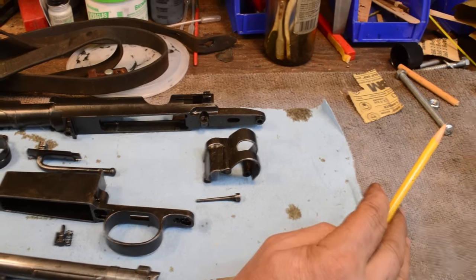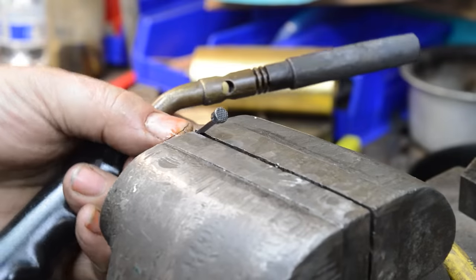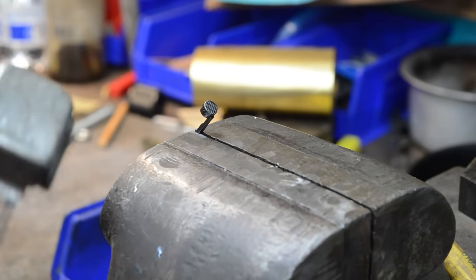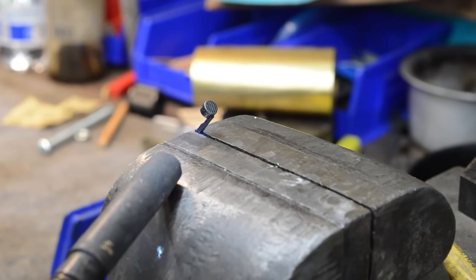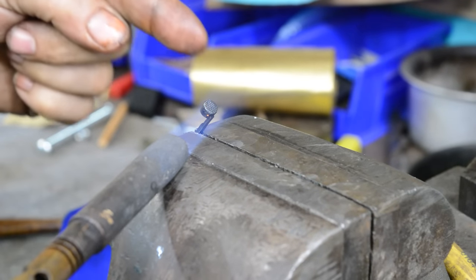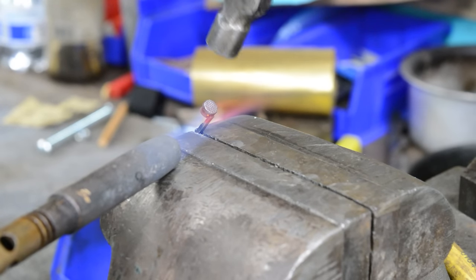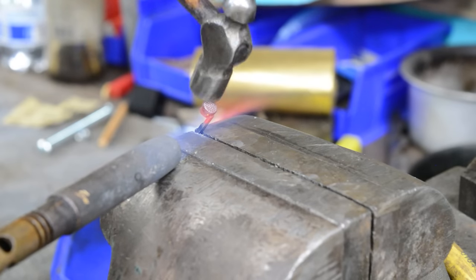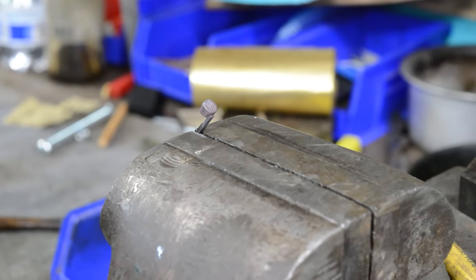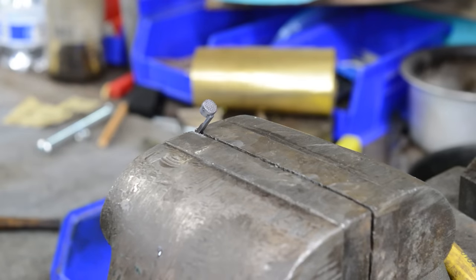There were some results of this inspection part. Let's pop over to the big vise and deal with that rear sight. This is the piece that was bent and I'm going to capture this here in the vise. Thin pieces of metal off hundred-year-old guns are things to be taken care of. We're just going to heat that up a little bit, and you'll see the color of the flame turns orange when we begin to get it good and hot. I'm not worried about drawing a temper on this — this isn't spring steel. And then all I'm going to do is just tap on this ever so slightly — and there it is, it's straight. It will cool off at a slower rate.